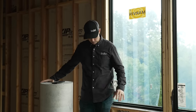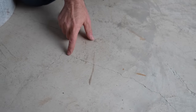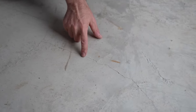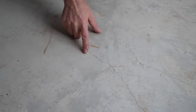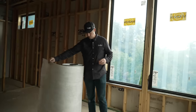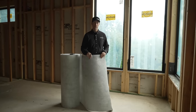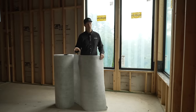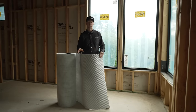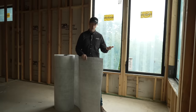So, cracked concrete. These cracks that you're seeing here are very typical to see on concrete. This is not a structural defect, but these cracks will affect the structure of your tile if you're adhering tile right to them. And this is how we're going to prevent it. Uncoupling membranes and mats like this have been around for a long time. I've used them probably for about a decade now, and I can tell you they will prevent those cracks from migrating forward.